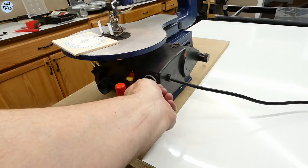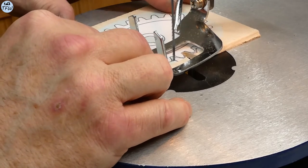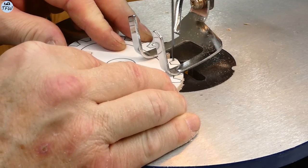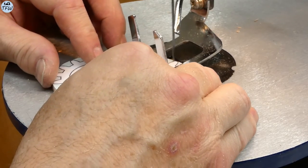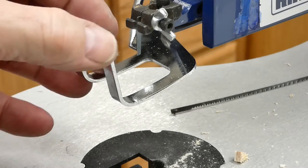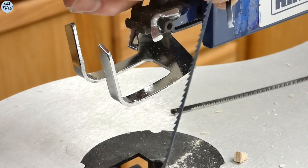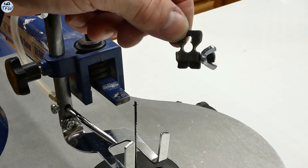When doing any scroll work, I highly recommend securing the tool to a work table somehow. I've got mine attached to some MDF, which is clamped to my work table, though you can screw or bolt the saw to your workbench as well. Regardless of what scroll saw you buy, you'll need to secure it to a work surface because the vertical motion of the saw arm makes the tool bounce and you'll need it to be stable as you cut. Nothing really makes you jump back like the sound of a snapping saw blade, but with both ends attached to the tool, it isn't likely that pieces would come flying off. Still, you should always wear eye protection and a dust mask when working with this tool.